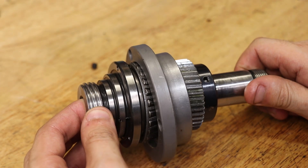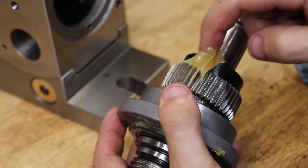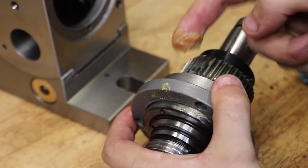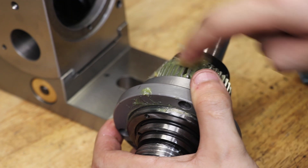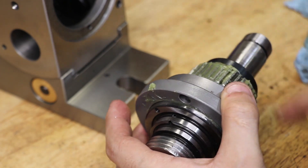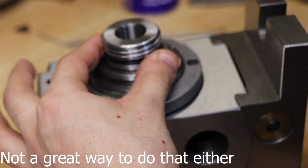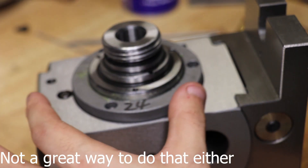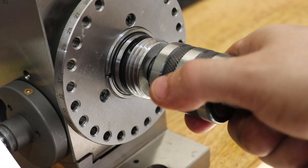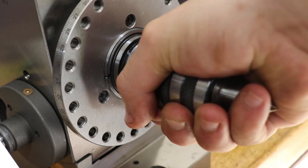I cleaned out the gear and bearings as best I could and added some new grease rated for use in bearings and gears like this. The consensus online is a bit split on whether to use grease or oil. Even though there is a button oiler, it doesn't deposit oil on the gear very well, and since I'm not going to open it up for a while I've settled on grease — plus this thing tends to leak oil, so grease keeps everything cleaner. Now that I can take the chuck off, I'm able to use Morse taper tooling; a Morse 2 taper collet chuck could be used in this dividing head.